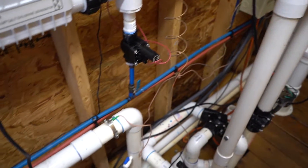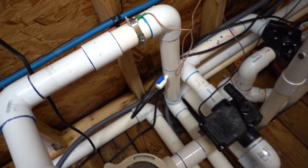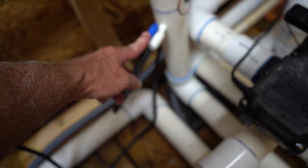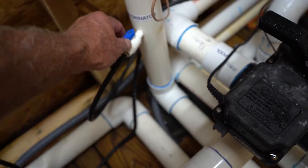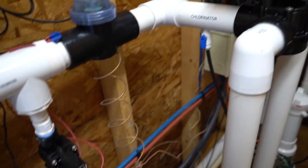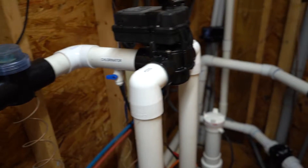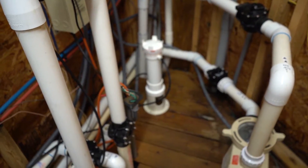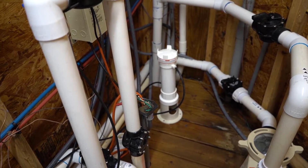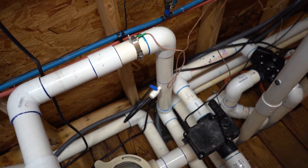The last thing in the pool system I really want to address is what's called the chlorinator. The chlorinator feed comes from here — this is a mini valve. If for some reason the line were to split or something were to go bad with the chlorinator, you can actually shut that off, and then shut off the other side as well, which would prevent the chlorinator from working. You would put tabs in it, and you can control the flow to the chlorinator through these two mini valves to keep the pool properly chlorinated.